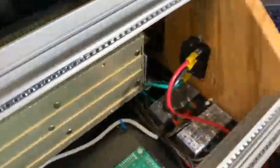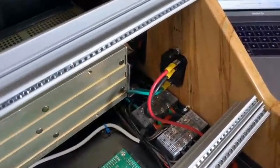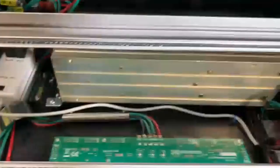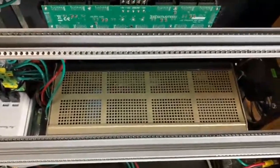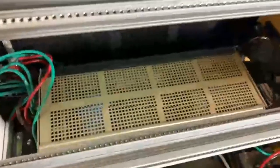But I had to learn a lot of things while wiring this thing up. Like, I really had to watch things like what was ground, what was live on the AC inlets. The fuse goes on the live. Most power supplies, these linear power supplies here, the laptop bricks that you use to power up your mobile case, the switching power supplies that go into cases like the Mean Well, they separate the ground on the AC side from the ground on the DC output.